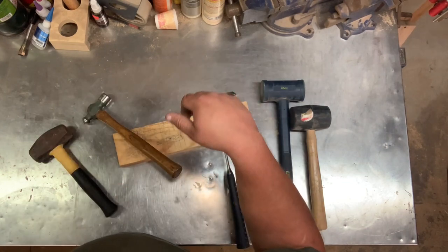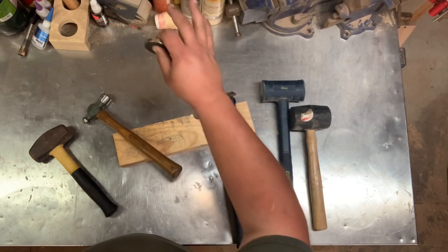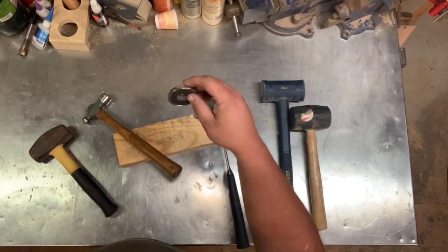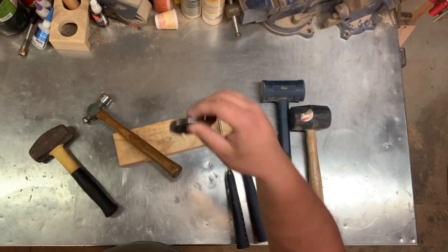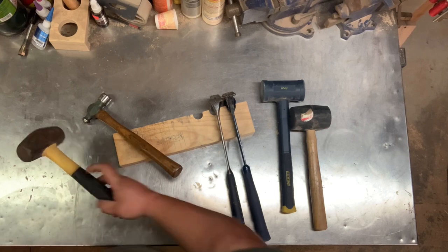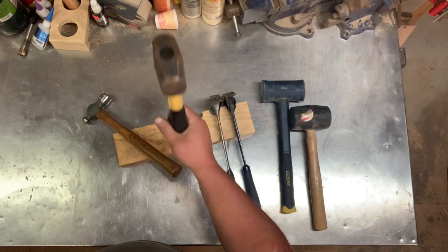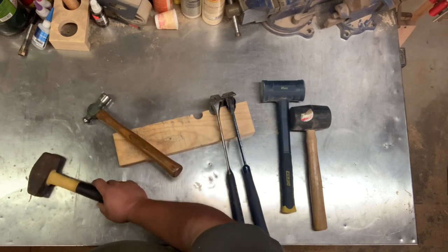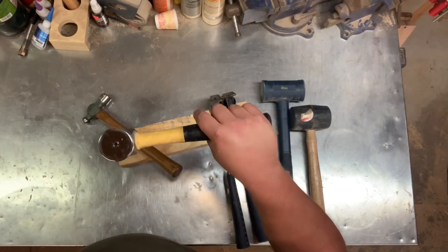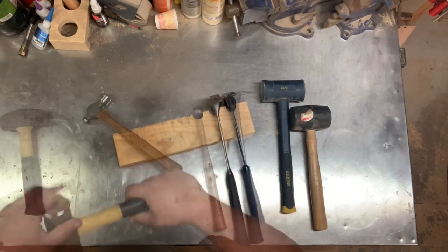I'll drill out a 2-inch hole near the top, and then on the backer piece that the French cleat is made of, I will attach the magnet to the back, right behind where that is, because this is 2-inch also. So I can just knock this right on there and the magnet retains it and doesn't let it fall off, but it's not wasting a whole lot of space either. And the 2-inch Forstner bit is, well, you can see it right there. It's just about the right diameter for the little mini sledge. So that's my design process.